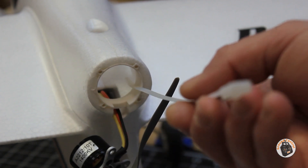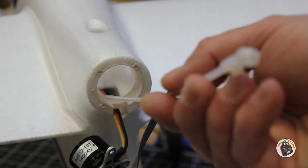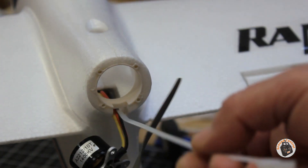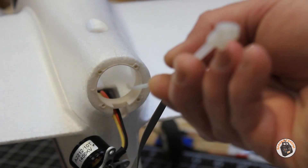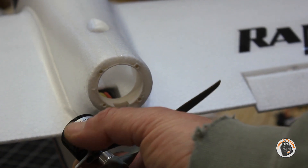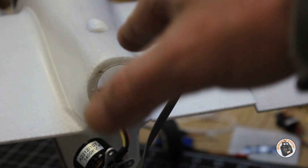I think that's going to work out fine. If I can get that shaved down a millimeter and give a millimeter of clearance to the motor so it's not rubbing this inside housing on the far side, I think this modification is going to work. I'll go ahead and take a picture of what it looks like beforehand, and then after I'm finished to show you a close-up of exactly what it looks like before and after I start carving the inside of that motor mount, and then we'll be able to get the spacer in there and get that thrust angle correct.